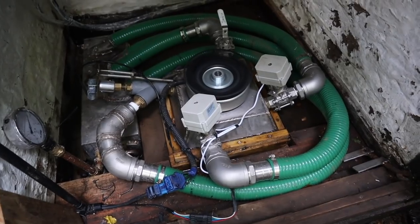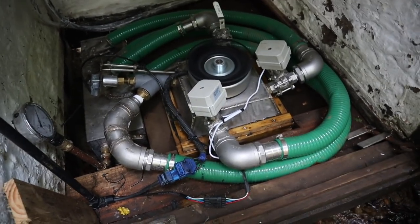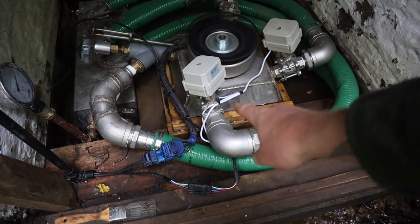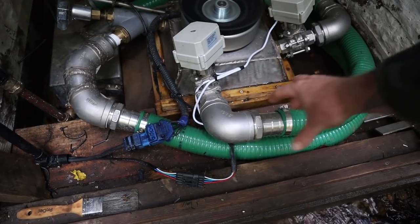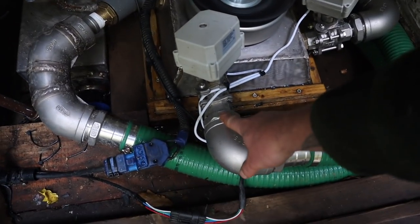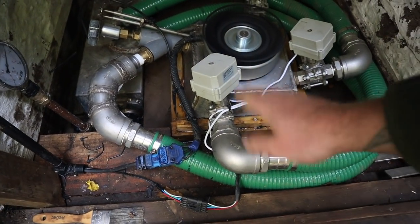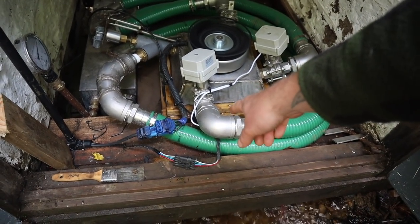Okay so we're down at the turbine, it's all running at the moment but I'm going to turn it all off. With efficiencies the best place to start is where the biggest loss is, and the biggest loss is involved in this nozzle here because it's the biggest nozzle and it has a 90-degree bend on it. In this video we're going to adjust the height of that nozzle and sort out this bend to make it more of a sweeping bend. I reckon we might be able to get another 20 watts out of this nozzle.